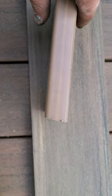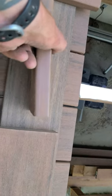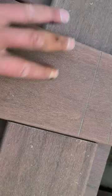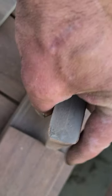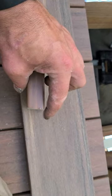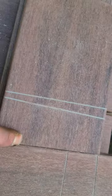The other part of that equation is that the ends of my decking are beveled by about two degrees. The other half — which is not beveled — that's a square cut up against a piece of material that has a rounded edge. That's what you're catching your fingernail on: a square cut up against that rounded edge. This piece has a beveled cut sitting onto that square piece.